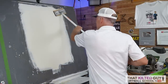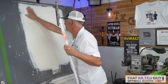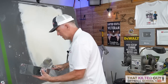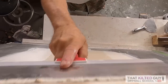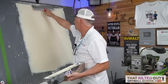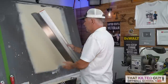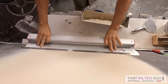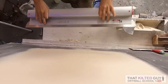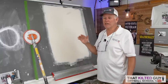We're going to give it a light brush sanding just to knock off the rough spots. Vacuum off the dust if you can - dust makes it harder for everything to stick. Then a medium-thin coat, thinning it down as we go. Pull a little out of the middle, take a little off the sides. Just a pretty tight skim coat. We're going to let that dry and check how good it came out using the pro-grade tools.